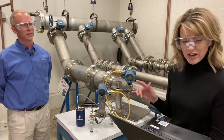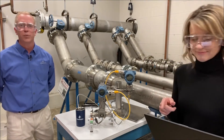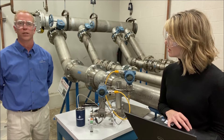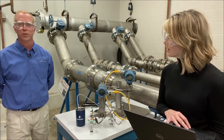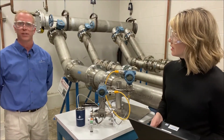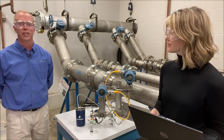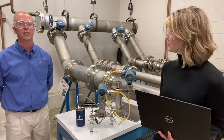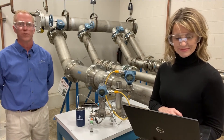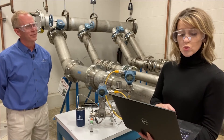Question: how does the pressure transmitter communicate with the vortex transmitter? The pressure device uses what's called HART burst mode — it's bursting the information from the pressure transmitter and the vortex device digitally captures that. It's what's called a catch variable — the digital communications acts almost like a baseball glove, catching the information on the bus as it communicates from one device to the other. The vortex device captures that information and uses it for the calculations.